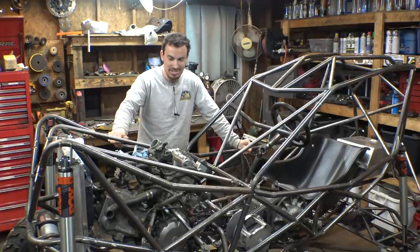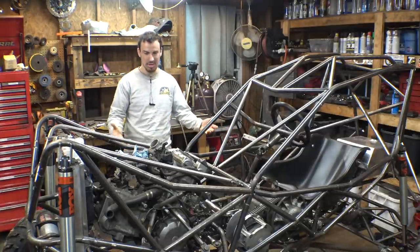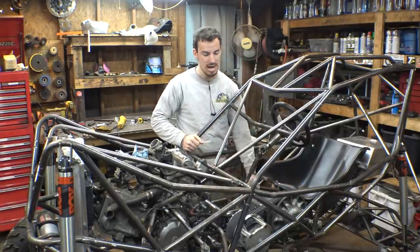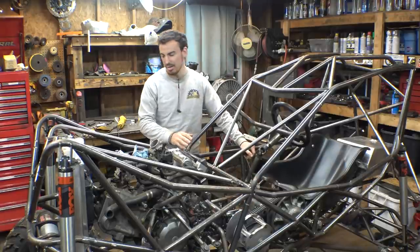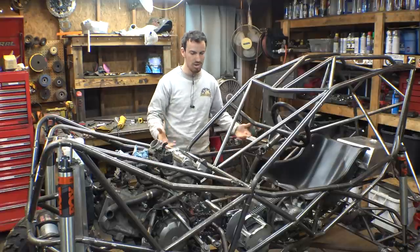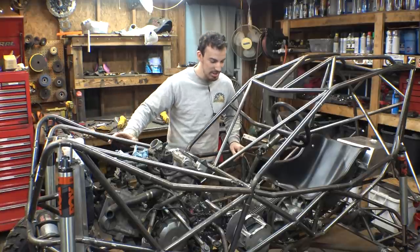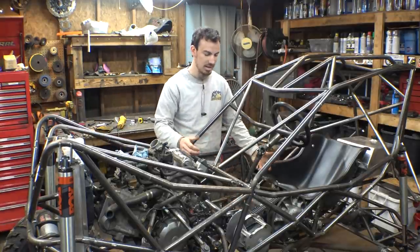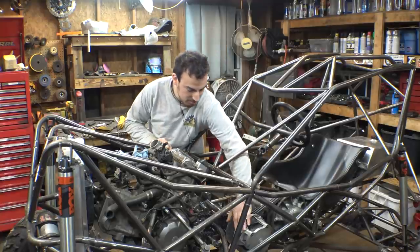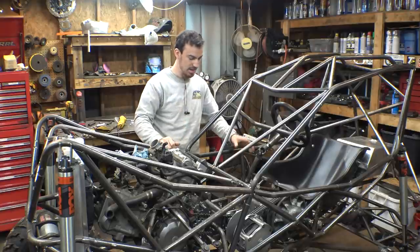So now we can start working on the semi more interesting stuff. I know it's still not as interesting as seeing this thing running, but it's what we have to do. Anyway, what we need to do is somehow put a cover over the CVT. I'm only going to do the top, just because I'm planning on putting side paneling on this whole thing, skid plates, just so it looks more like a rock crawler. I keep calling it a rock crawler. So I'm not worried about putting any covers on the bottom of it because the frame's going to be covered. All we need to do is put a cover over the top, so my leg doesn't get sucked in the CVT and I can put my foot right here. And once we do that, then we can start working on the brake pedal, throttle, as well as gear shifter.